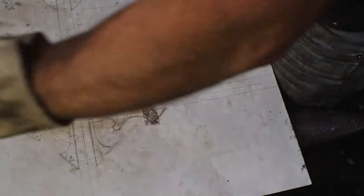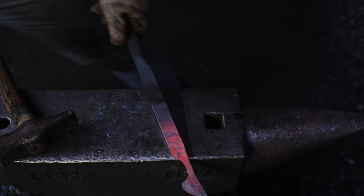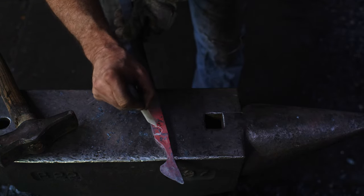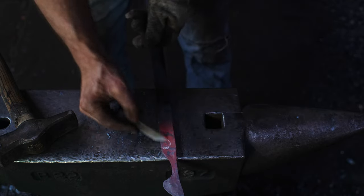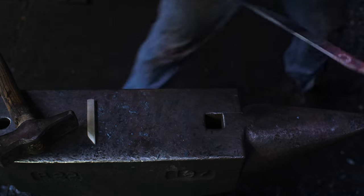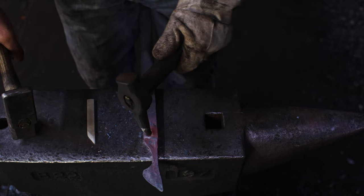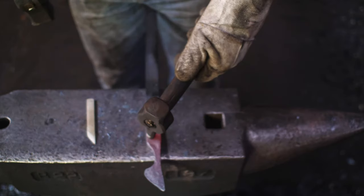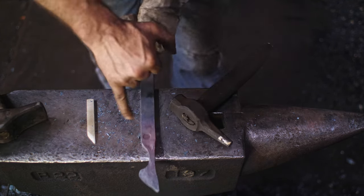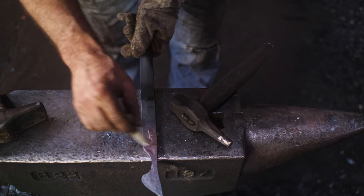I need to bring this ear up for my second notch. I don't really want to notch this on the anvil like the other one because things are going to thin out and stretch uncontrollably. So I'll actually punch out the next notch using a hot punch. Now we're at cherry red. I get that mark there — that's what I need for that radius. That keeps us at full thickness here. So let's punch that out.